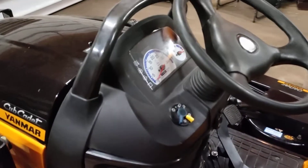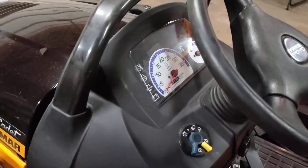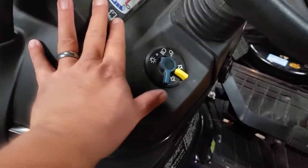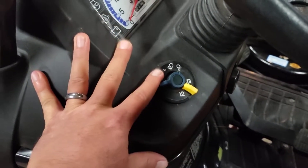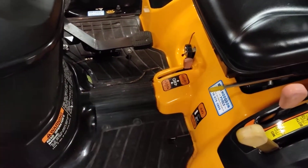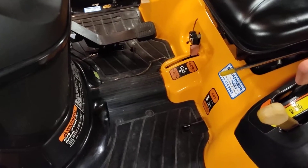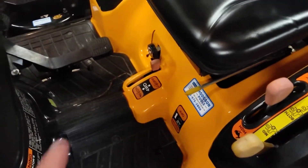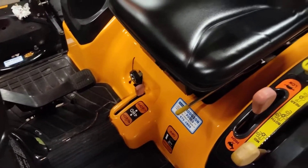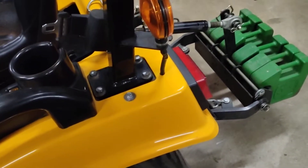Here on the dash, it's a very simple dash. You've got a large tachometer, fuel gauge, and your idiot lights. I kind of wish it had a temperature gauge, but that's fine. You've got your lights and an extra position for the auxiliary lights as well. Four-wheel drive is down there — it's kind of a weird spot, you've got to bend down to reach it, but I'll get used to it. Then you've got your diff lock, and the knob there controls how fast the three-point hitch falls. Or if you have weights on it and you want it to just stay there, you can turn it all the way in and lock that down too.